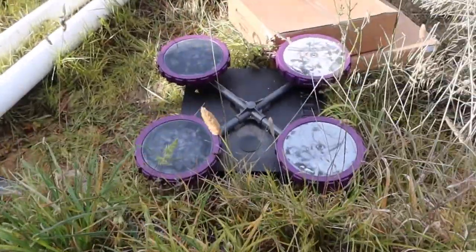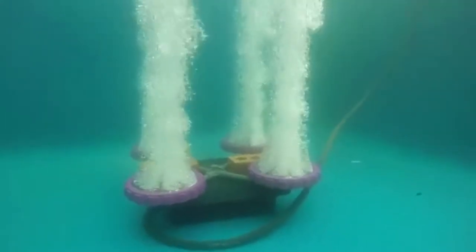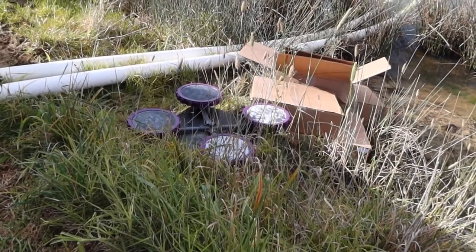We're installing today a Vertex aeration system — two four-disc aeration pads that will sit on the bottom. We're running this with a compressor inside a cabinet in a shed right next to me. Another key advantage of the subsurface system is low power consumption — this is only a half-horsepower compressor, so very low power consumption for aerating a water body of this size.